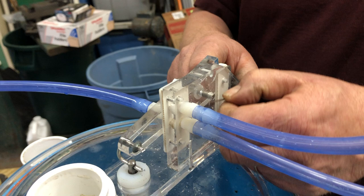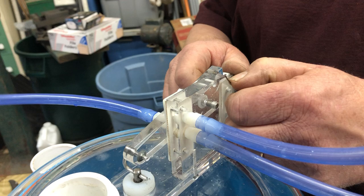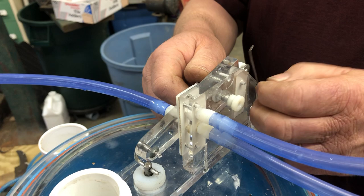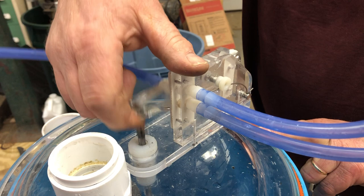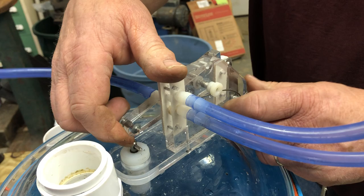You have to adjust this — sometimes you play with it up and down. You don't want it to hang, so that would be too tight. Instead of straightening it, you want to bend it. This is a fixed point right here, so you want to have this spring set to the right amount of pressure so that when you raise this up, there's enough detent. When I let go, my fingers are way over here before that thing drops. With no spring on there, I can barely get my finger away and it drops down. So this is your detent point for your vacuum.